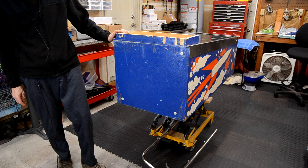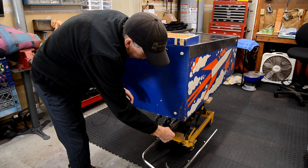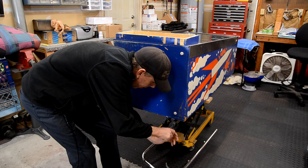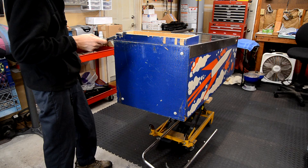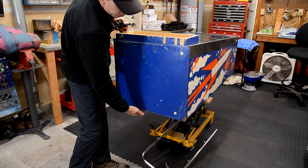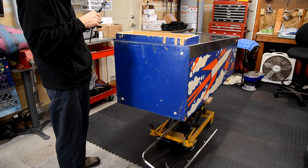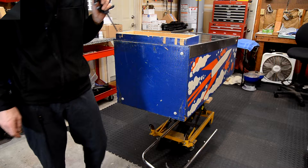Last night I went around and used wood glue to fix all the outer plies that were loose. I peeled back each loose section, brushed some wood glue in, squeezed it down, and clamped it overnight. Now I'm going to make this restore a bit more involved — I need to flip the cabinet over since there's damage underneath, so I'm going to gut the inside first and take pictures before tearing anything apart.